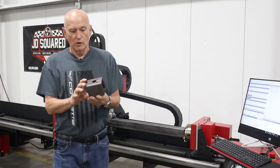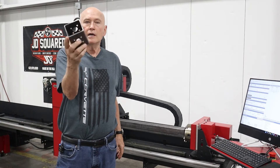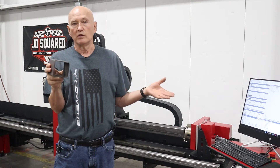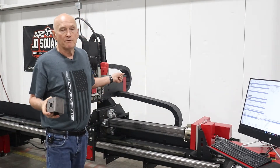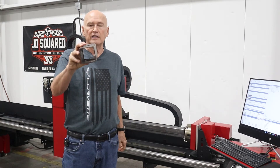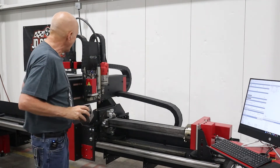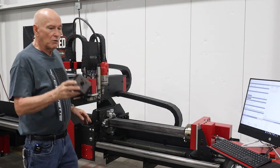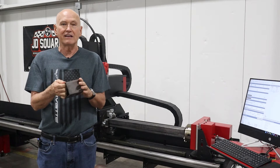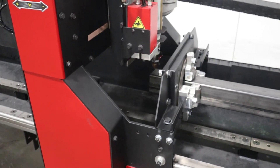Here's what we're going to make: we'll drill eight holes, plasma-cut a large hole, then cut off a part about three inches long in three-inch square tubing with an eighth-inch wall — 75mm square tubing with a 3mm wall. We're drilling with an 8.5mm drill, which is about 0.33 inches (a little over five-sixteenths). The drill is a used drill, so we'll see how the holes come out. I'm going to videotape this in its entirety so you can see both sides.